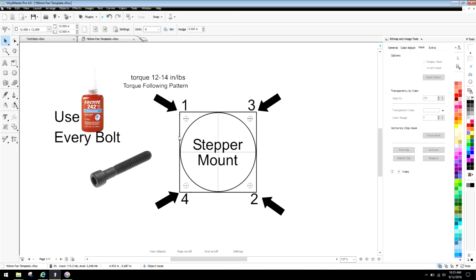So once again, just to reiterate, you guys now know the proper mounting methods. And again, if you're doing home switches, you're going to adjust the torque. And when I say adjust the torque, you're not going to use anywhere near close to that. You don't need that. But the big thing here, make it applicable to what you're doing. Follow this principle. If you're using a 440 screw to actually mount the home switches to your chassis, use Loctite. Again, reduce the torque down, maybe 2 to 3 inch-pounds. You do not need a lot of torque for them. Again, you're using Loctite, you're doing everything right now, you don't have to worry about that.